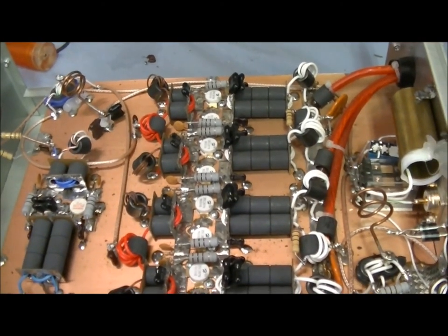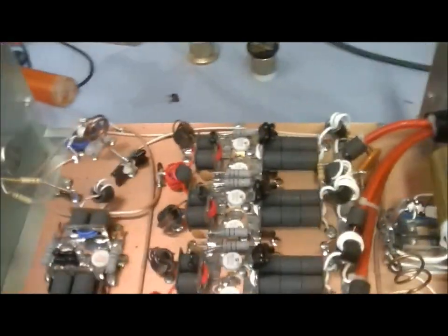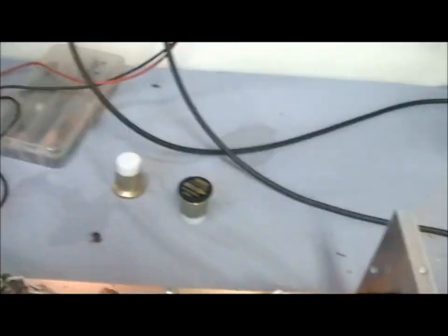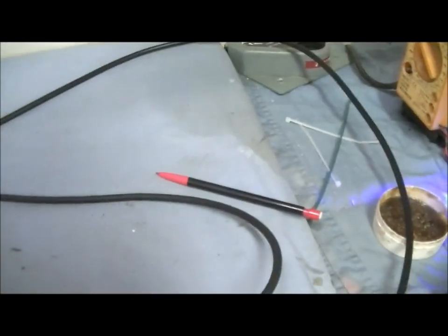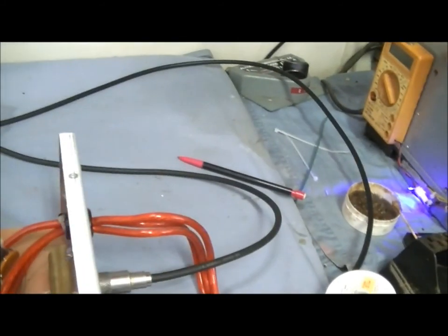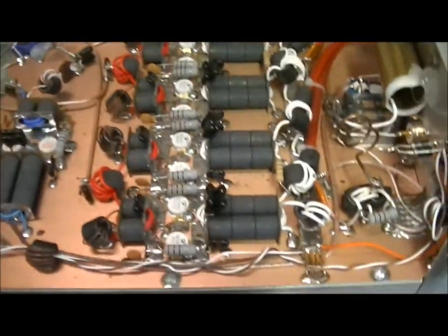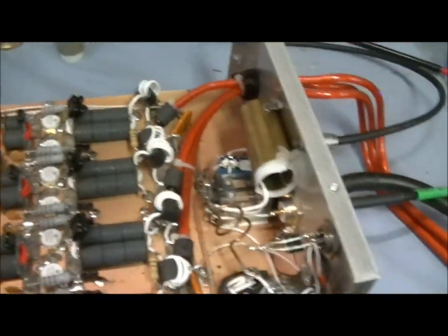I like my radios to be stock, no hacking done to them on my tuning radio. So I'm on my bench radio. It does about 4 watts RMS right there. We're only showing about 3 right now, with a little bit of loss through the cables and all that good stuff. This radio may not be as strong as my other one, but as long as I'm at 3 to 4 watts, that's all I'm really wanting.